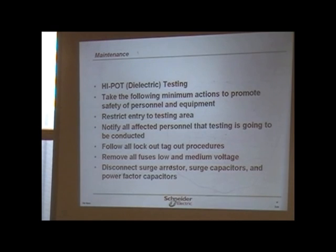Depending, and it makes no difference where we're at in this scenario, let's go to the low voltage side to make it a little bit simple. Because this is not a breaker, these are switches, so switches really will not trip. You have to manually open them, okay? That's what you have to understand.